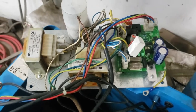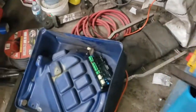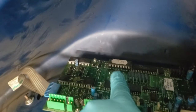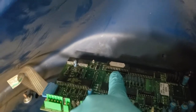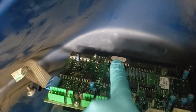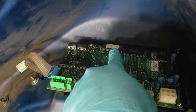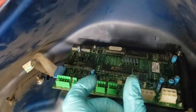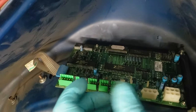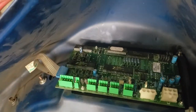Balancers are pretty simple — it's just your input board. This board has your processor on it. Before doing anything, you can buy EEPROM readers for these and copy the chip data, saving it to a file on your computer. That way you've got a backup in case something screws up on the board. These boards are easy to fix except for that processor chip — if you lose the data on it, you're in trouble. So definitely back that up if you're able to.